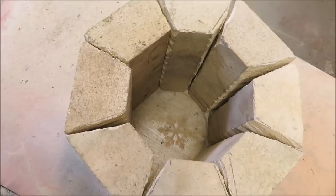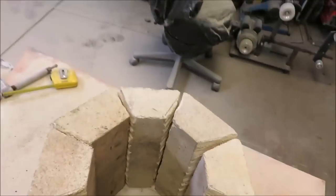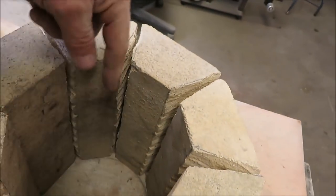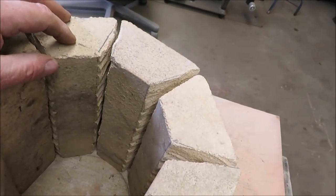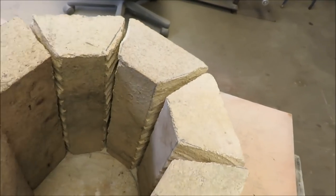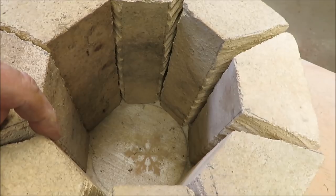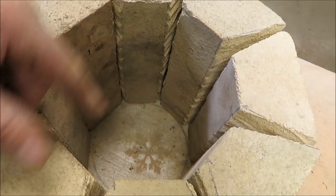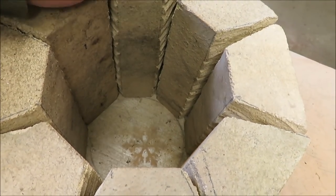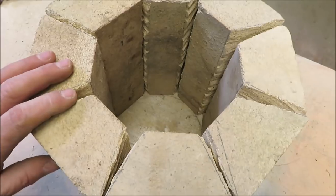So let's take a look down in there - I don't think it's that bad. Would this thing work as far as a blast furnace goes? Now I know I'm going to have to cut a hole in here for my air, somewhere for my gas burner to come in there - I'll just do it the same way I cut the brick, notch it out and get it to go in at an angle. I'm just hoping that the inside is big enough for the crucible I got. I got a crucible - I think it's a size 4, and I think that hole in there is about 6 inches round. It's supposed to fit a pop can, so hopefully this thing is going to be big enough. That's what the inside looks like.